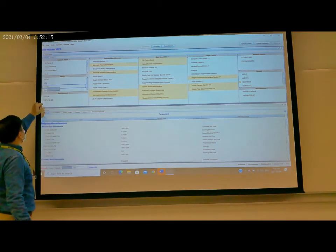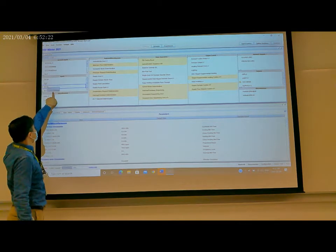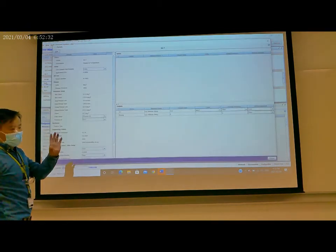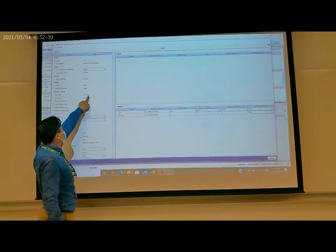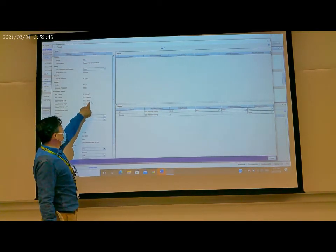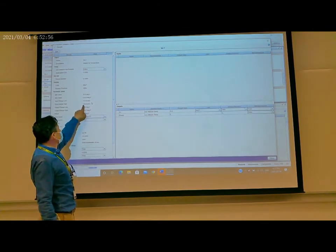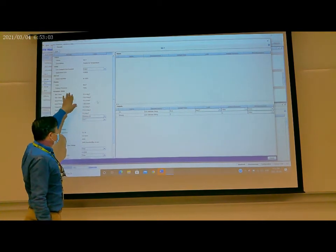And then the SA, this is a supply air temperature. This one we need to check. This one is a resistive input, which is the RTD we use. This is a resistive RTD, it's okay. Double click, check the calibration for the RTD. If the temperature is 32, the resistance of the RTD is 101.8 ohm. If the temperature is 212 Fahrenheit degrees, the resistance is 138.8 ohms. This is the calibration for the RTD.